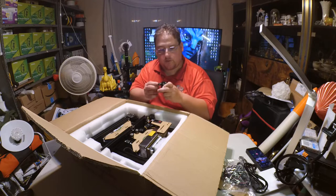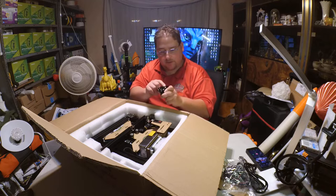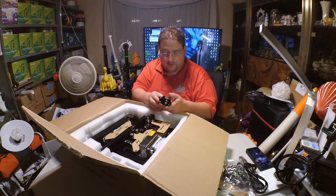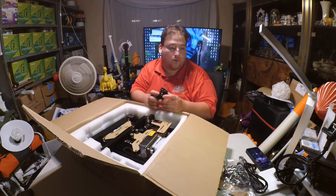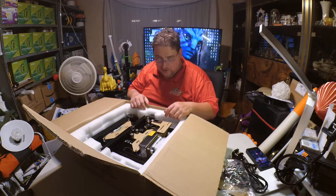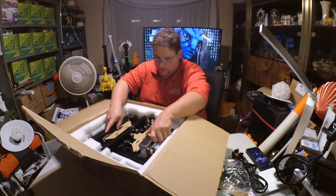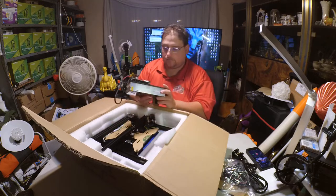Yep, big thick acrylic plate. But metal, actually that's metal. Yes, that's aluminum, all metal, but the plate for how it attaches to the printer is acrylic. Looks thick enough. That's not under load, so it should be fine. As long as the actual base and gantry are metal, that's what's important, because those are the parts that want to wiggle. And we don't want them to wiggle.